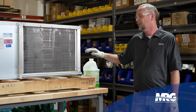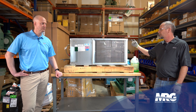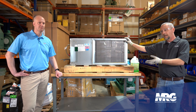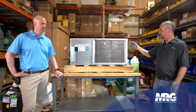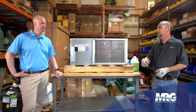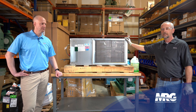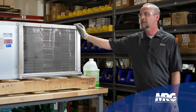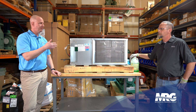A good rule of thumb: look at the data tag and see how old the unit is. If you've got an air handler that's been in service 15 to 20 years, this method probably isn't going to do it — you'll need to break out the hose pipe, a much stronger coil cleaner, and use water pressure to push through the coil. Be careful though — with a very thick coil you can take surface dirt and push it inside without it coming out the other side, making the problem worse.